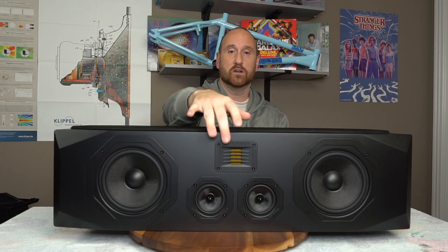Let me switch to the data, but first — what did I hear when I listened to the speaker? Bass: really quite good for the size. Mid-range: good. The 1–2 kHz region is where those issues start to show up. I heard it a little before I saw the measurements, but when I saw the measurements I was like, 'okay, that explains why it sounded weird' — it wasn't just a boost, it was a dip-boost combo. High frequency: this tweeter has a natural tendency to be too bright for me. I really like the T2 Plus tower and B1 Plus monitors — they share that same characteristic.